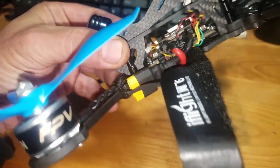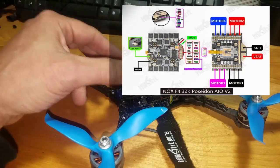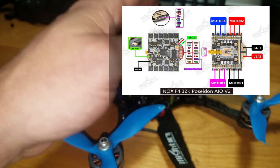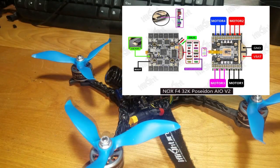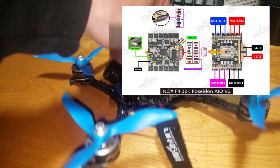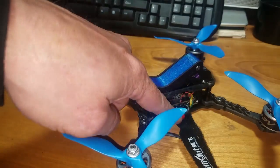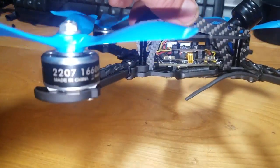When you first hook up this flight controller to the computer, it will show you that forward is forward and back is back, and the ESCs will be lined up to the outside of your quad. I don't know how to tell you this, but that's wrong — what you're seeing is deceiving. The best way to have this lined up is just the way I have it, with power wires off the side, which allows you to have your USB off the other side.